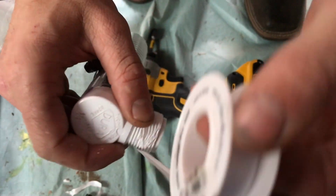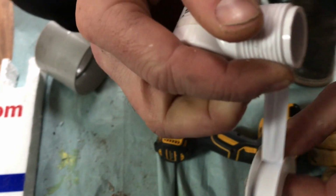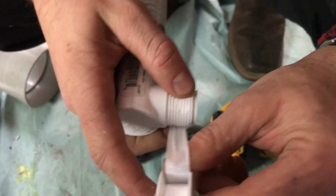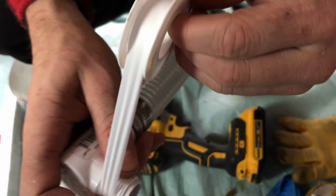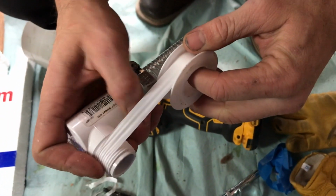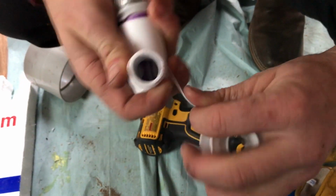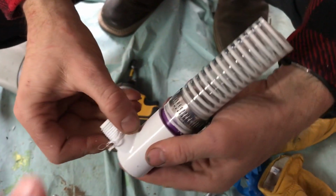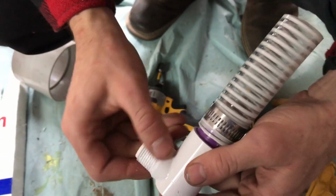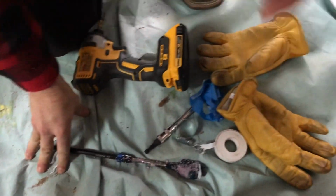So we're currently adding some thread tape to, we bought a 90-degree coupler. I think ideally we would have this drain kind of going angled into the ground because you don't really want any spots for liquid to pool. But given our very tight quarters, we don't really have an option. So we have a pretty short length of pipe that will be horizontal, flush with the ground, and then this 90-degree coupler that will do kind of a 90-degree turn and go into the drainage spot.